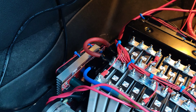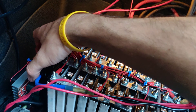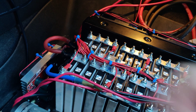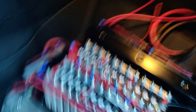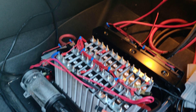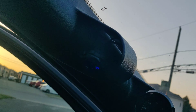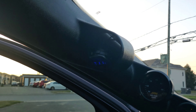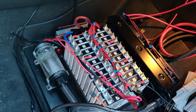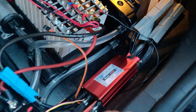Right here I have a step-up for my 12 volt from the car, step up to 34 volt to charge the battery through the BMS — this is a battery management system and it balances all the cells. That was the first problem: the BMS blew up after like 15 minutes. But now it's working pretty great. I have a voltmeter there, but I need to 3D print something to go in the gauge pillar. The BMS and all the battery are balanced pretty good. And now for the ESC.